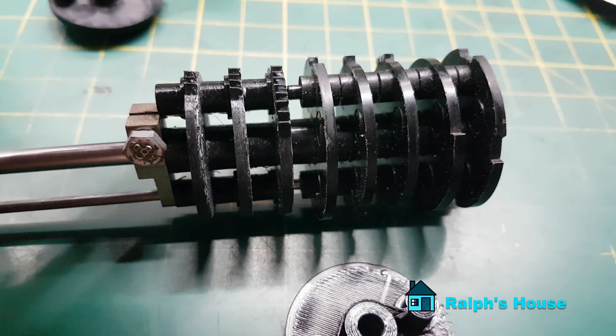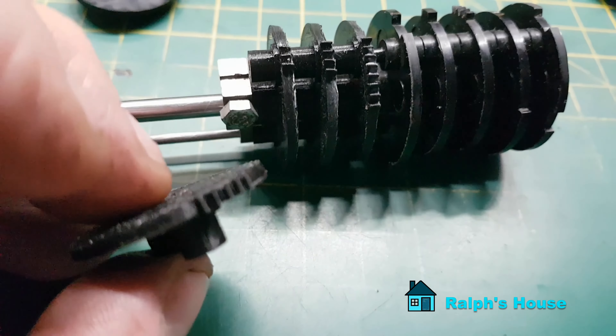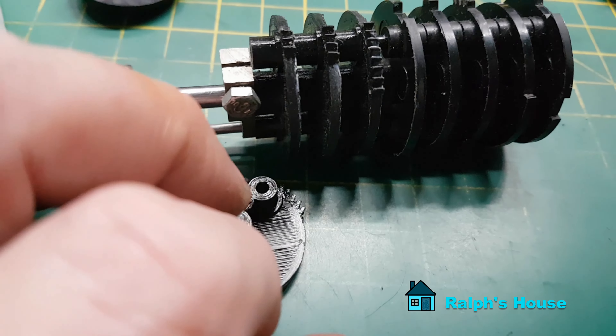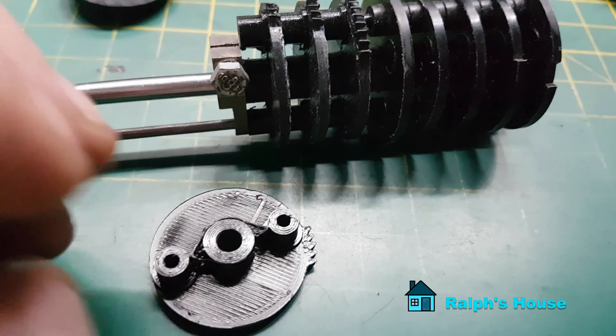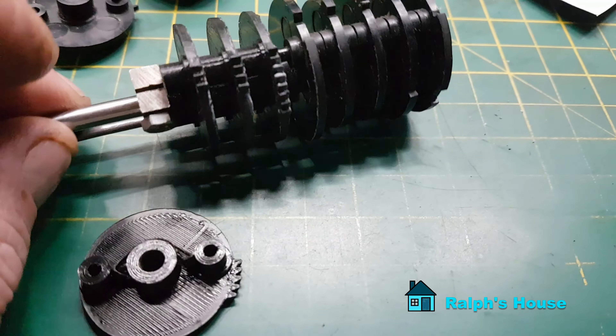So if you get a triple one you'll get £1.60, if you get a triple two you'll get 80p, and there are three notches for the triple four payout - actually it's misplaced and needs to go further down. It's easier to get a triple four since there are more fours in the pay slots below. Hopefully that's helpful. I'll print some spare cam wheels - I'm going to keep spares with this machine: a spare ball, a few spare springs, some extra cams, so we should keep it running pretty much forever.